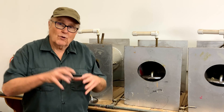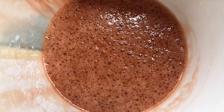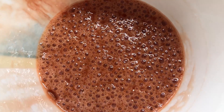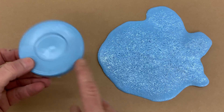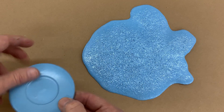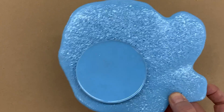I use pressure in the process of pouring the resin, and its main job is to suppress the formation of bubbles in the resin. Here's what resin looks like when it's foaming — I mix the A and B side and it's making the curing reaction, but water vapor has gotten into the resin. If water vapor gets into your resin, it's going to foam. Unless you want this effect, it's a disaster. But look at the power of the pressure pot: I saved some resin from the same batch and put it in the pressure pot — that is the difference. The pressure pot prevents the formation of bubbles in your resin. That's its main job.